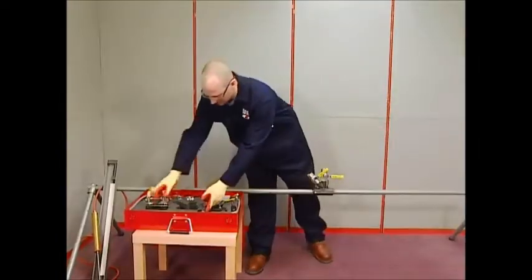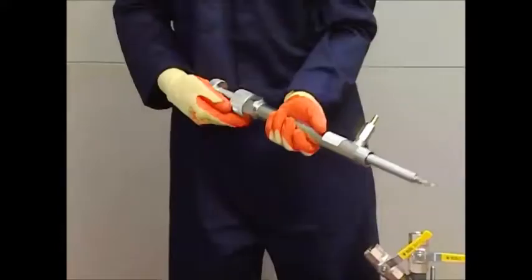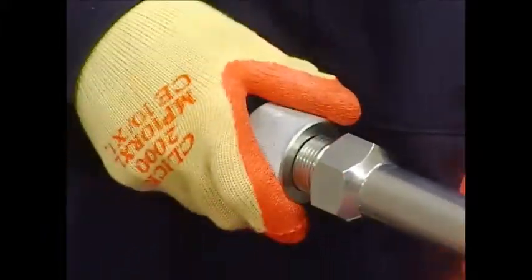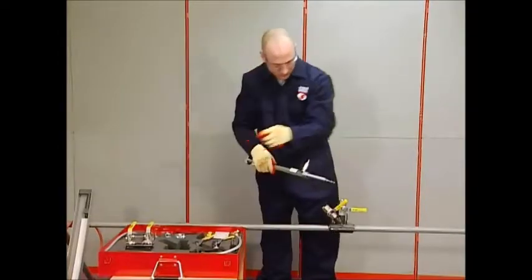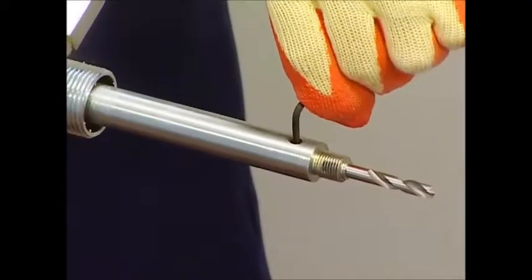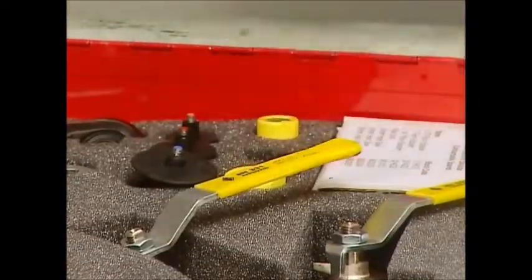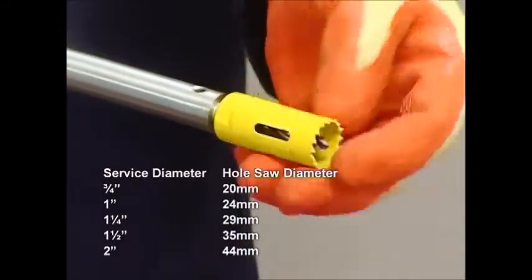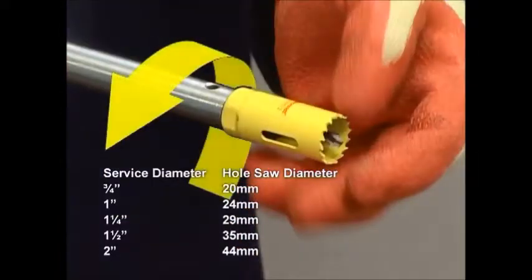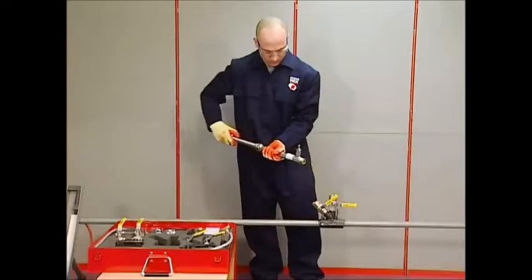Next, take up the drill. The drill has a quick release mechanism — make sure that the feed screw and quick release thread are clean and undamaged, removing any tape left on from a previous job. Using an Allen key, check that the pilot drill is in place and tight. Select the correct size hole saw and attach it — here we're using the 24 millimeter size for the one inch pipe. Spin the drill shaft and check alignment, then draw the shaft back up into the drill.